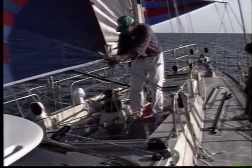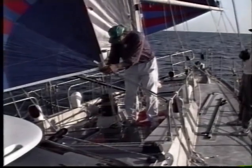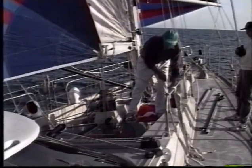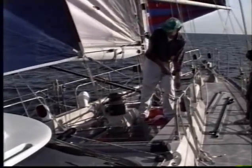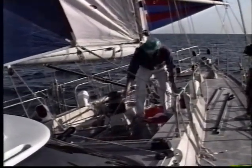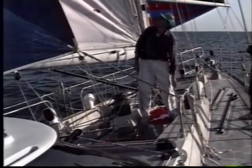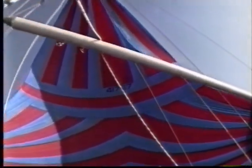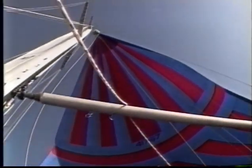The luff is adjusted between the center line and rail with two tackles. These sails represent a careful balance in design. They are optimized for reaching with just enough draft to keep them stable off the wind. And they're heavy. The big chute is 2.2 ounce, while the smaller spinnaker is 1.5 ounce. This means they're strong enough to take the odd mistake in stride.